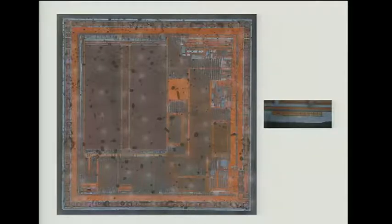I let this go for a while, then I saw a talk by Travis Goodspeed at Source Boston on decapping chips to identify radios. I asked him about removing epoxy, and he kindly offered to decap the chip using nitric acid. After that, I got a chip that looked like this. Travis described it using the strongest word in his vocabulary — he said it was 'unneighborly.' There is only one marking on it, which is a serial number.